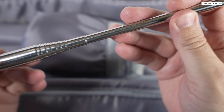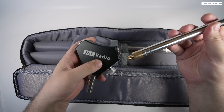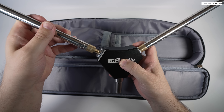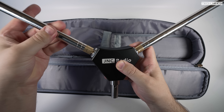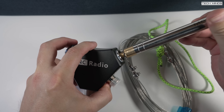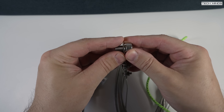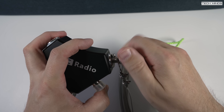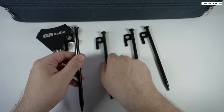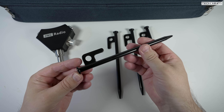You may be wondering how accurate these markers are — later in the video I'll go through each band and show you the results on my antenna analyzer. When using bands from 20 meters up to 6 meters (14 MHz to 50 MHz) you just install the whips. For 40 meters you install the wires, which can be held in place by the fully retracted telescopic poles, or you can purchase M10 bolts designed for these wires — they have little indents so you can tighten them with fingers and thumbs. The kit I ordered also included a long length of guy rope and steel pegs of pretty good quality.